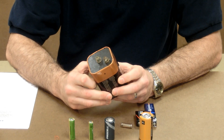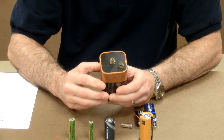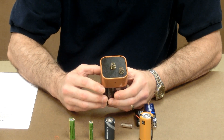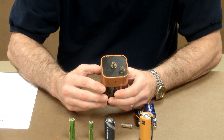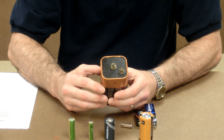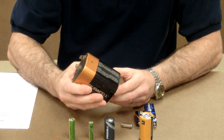The minimum number of cells we would need would be four. If we had four cells in series, we would get six volts. But we could also have eight cells where we have two rows of four — that combination arrangement with a branch of four cells for six volts and another branch in parallel for six volts. We could even have twelve cells.